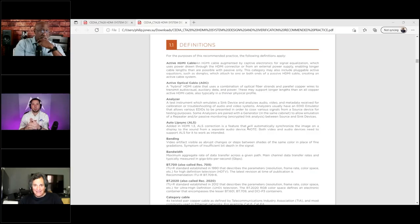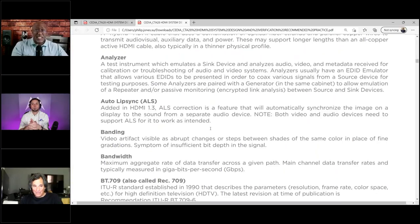Okay, and one of the things that I didn't know was in 2.1 when we started was something called auto lip sync. I've had auto non-lip sync for years. We know how to make non-lip sync work, but if you've got all 2.1 gear in here, lip sync issues that have plagued us for ages are gone. It actually works. That's a big one. If you look here, they describe auto lip sync, and people complain a lot of times if they plug in a TV and try to use the TV's internal Netflix, which is being fed to a receiver, and the voice was slightly off. One of the things they've added in 2.1 is this auto lip sync. Now you have to support a certain feature called ALS, but now you know that feature is available. And the cool thing for an installer, if you call tech support and we say, well, your device doesn't support ALS, you're like, huh? What's that? So that's one of the benefits of the acronyms.